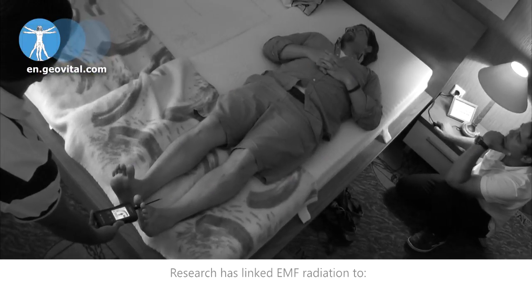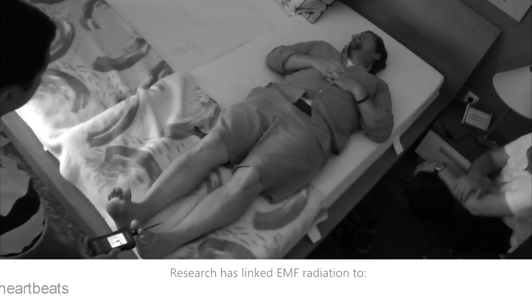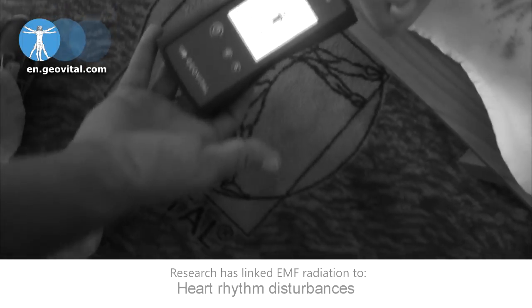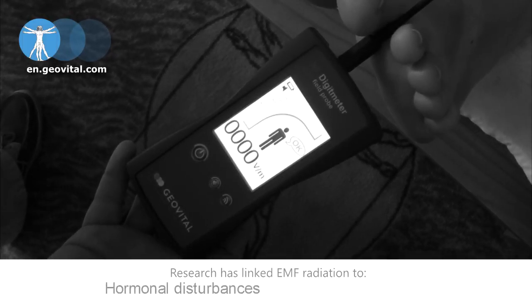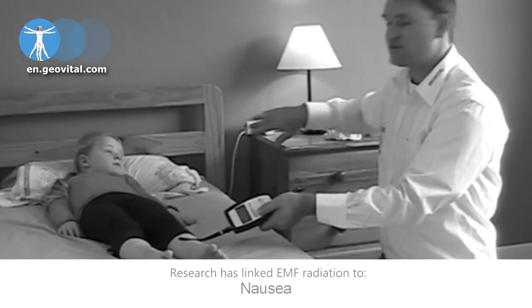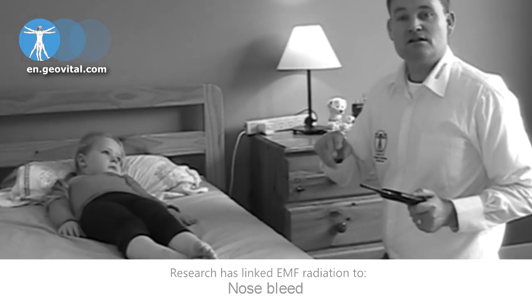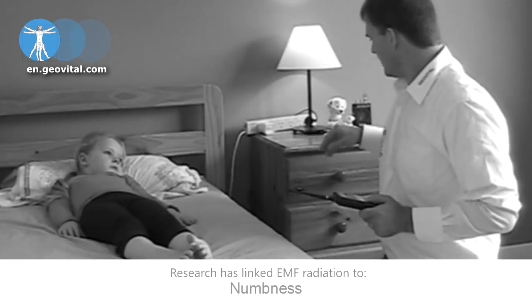Now we activate, and when we shut the light off to go to sleep, it takes about one to two seconds and the electricity is cut from the bed. The switch has the ability to sense if something is switched back on, and it instantly allows power back into the circuit as if it was there all along. When usage stops again, the power gets cut again. If I turn the bedside light off — the last device on that circuit using electricity — the circuit cutoff switch will realize there's no request for power and cut the supply of electricity to that circuit.